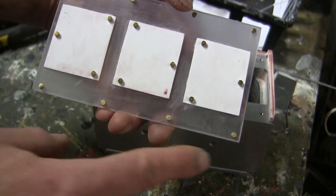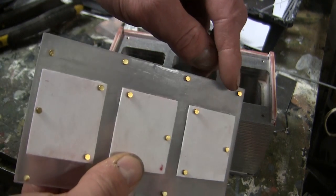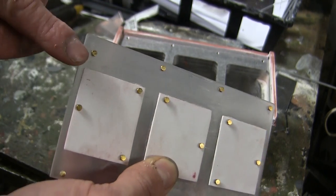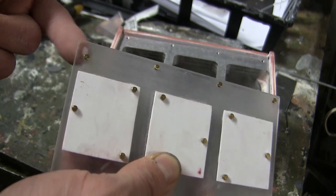As for the bolt layout, the bottom row is a straight line. However, the top row is straight until it dips down for this corner here. This is due to the make clearance for the antenna well, which is found on the turret casting itself.